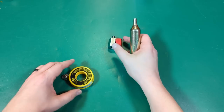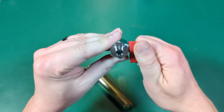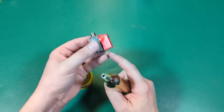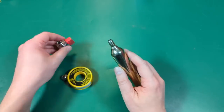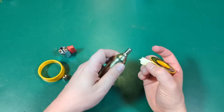Enter our refill kit. It's really just a ball valve. This is a valve that allows you to very quickly control whether or not that top is open or closed. We want to install the ball valve on here. We have matching threads. This is the same thread as this. This is the same thread in reverse, but metal on metal, not going to hold gas very well. That's why our refill kits do come with little PTFE yellow tape, yellow for gas fittings.